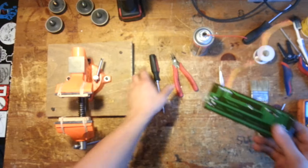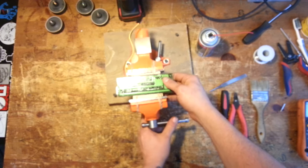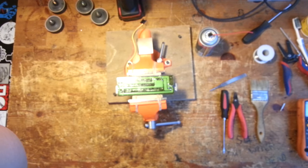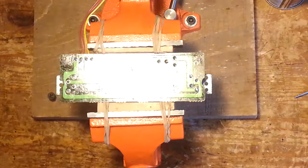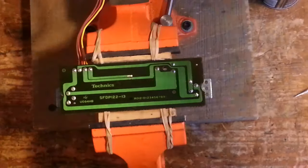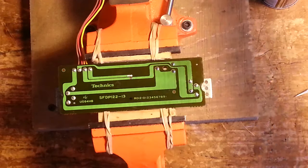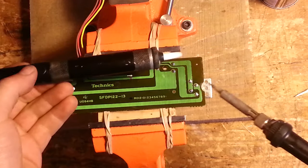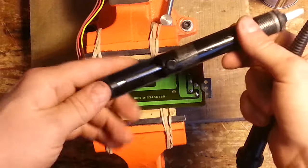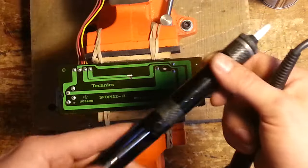Our first step — I'm going to use a vise here just to keep it steady for you to watch. First thing we want to do is remove the solder on these points here. I use this thing called a solder sucker. What happens is when you heat up the solder, this thing has a little plunger inside which you activate by pushing it down. When you put this little hole on the end up to where the solder is hot, the suction will pull the solder inside and clean out the hole.